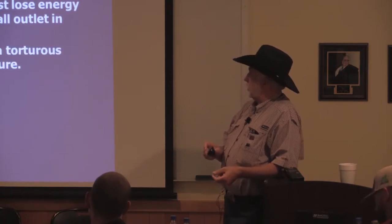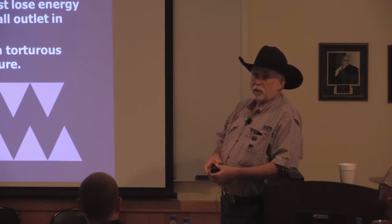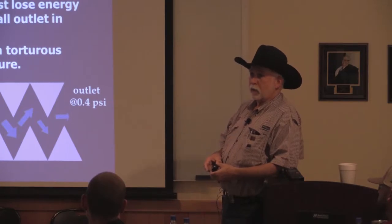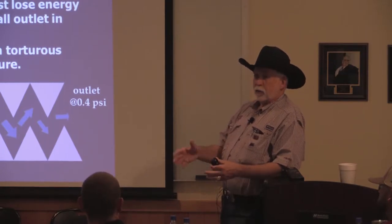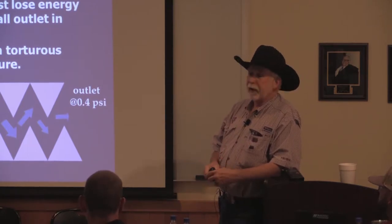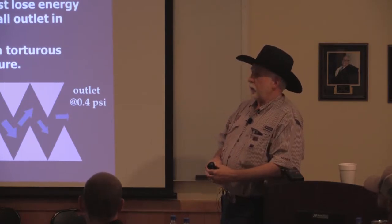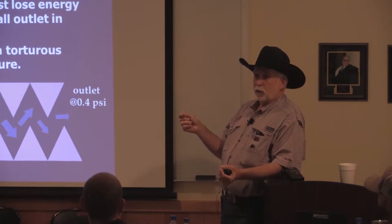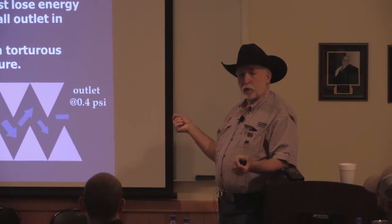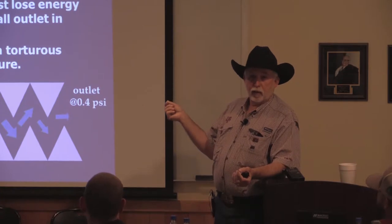And the first dripper that was ever designed was actually where Netafim started, down in Hatzerim, which is in the Negev Desert, in the southern part of Israel. In 1958, they sent a group down there, they started a kibbutz, and they said, we need an outpost down here, you need to make this functional. Well, they got down there, and they had water, but they had no way to put it out in the desert. And some guy decided if he got some spaghetti tubing, he could measure the friction loss, and he said, okay, how much pressure do I have on the tube to get a given flow? And he could calculate that.